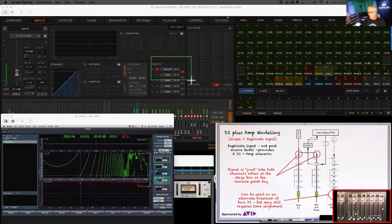Since the modeler's throughput is a moving target, you need to pre-measure each preset you'll use and know what time to put in play on each channel. If you have three or four presets, you need to know their timing in advance. If managing that alignment becomes too problematic when changing presets, you're probably better off just using the cabinet channel and dropping the DI entirely.